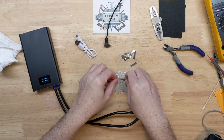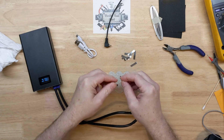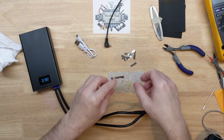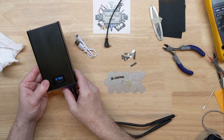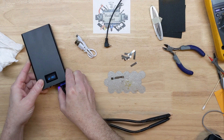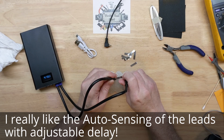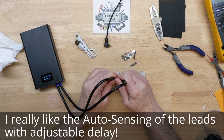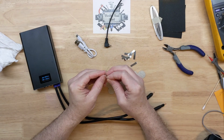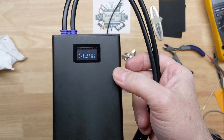Right out of the box it stuck together but didn't penetrate the best — it just peeled right off. So let's bump that up and try again at 15 milliseconds on the pulse, leaving our other settings as default. We can definitely see the leads jump a little bit. That definitely felt better — yeah, we're going to stay at 15 milliseconds. That held together a lot better.